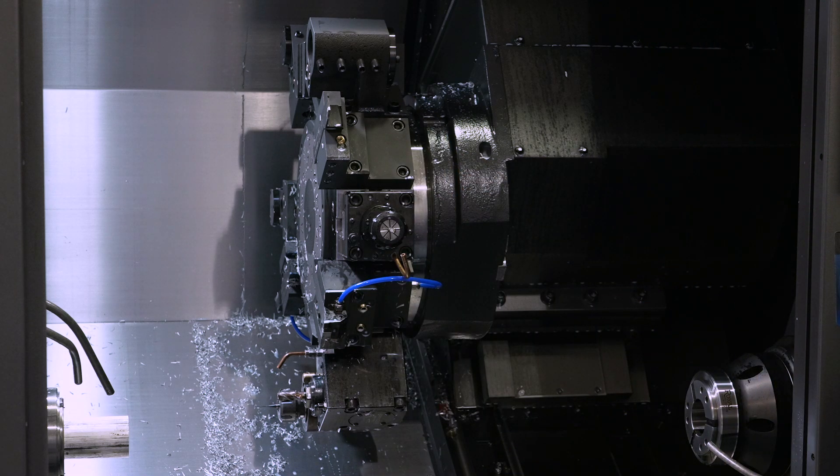This machine has a BMT 55 tool holder socket, so anything that is BMT 55 will fit onto it. It uses ER32 collets standard on the live heads and one-inch stick tools for turning, and is equipped with an automatic tool setter that comes down with a push of a button. The automatic tool setter makes it easy to touch off your tools in X and Y, whether it's a live tool or turning tool. You can set multiple offsets and set cycles to check your tools mid-cycle, and even make offset changes.